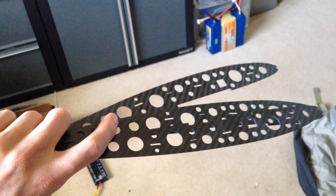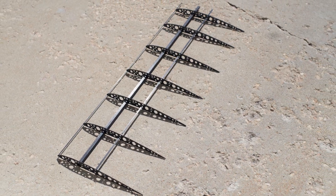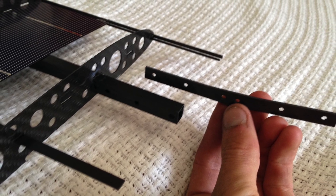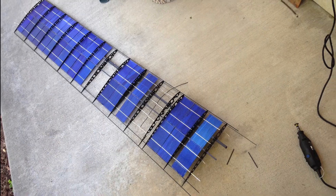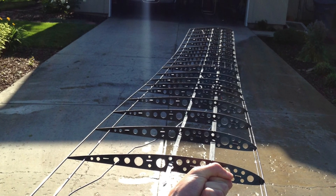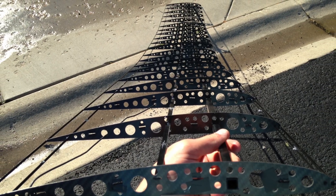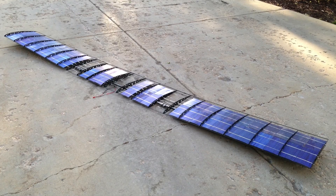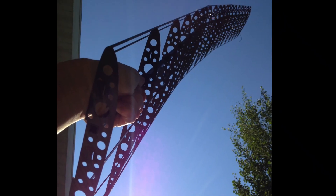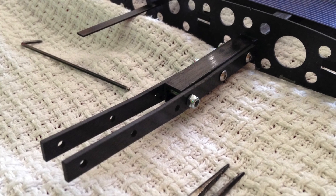After receiving these CNC cut ribs, I started assembling the wing skeleton. The main spar is made from 1 meter square carbon tube segments that bolt together with these angle brackets. This gives the wing some polyhedral. My original plan was to make a 2 meter wing with dihedral, but I had enough parts and materials to add a middle section. This puts the total span at 114.5 inches, or 9.5 feet, or 2.9 meters. The wing's carbon skeleton alone weighs 19 ounces or 538 grams — not bad for a 9.5 foot span.